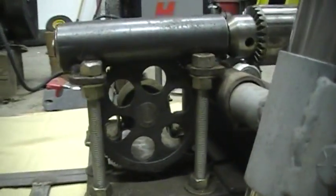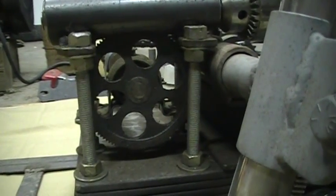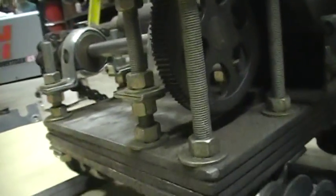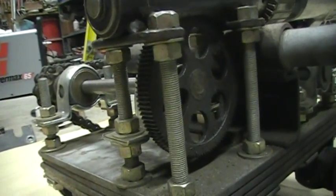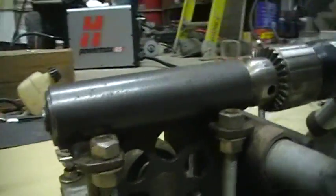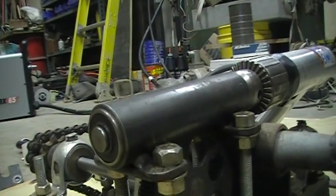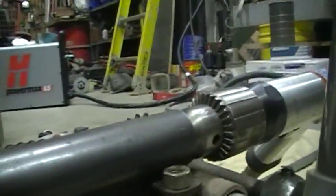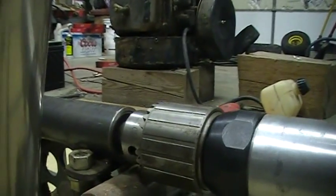On this end I found one of these little antique hand crank grinders. The gear is a really fine tooth gear, and it just so happened that a half-inch coarse threaded bolt laid perfectly right in the threads. I took it up to the top — you can see the bearing I put in there. I machined that out and machined the end of the shaft so it would fit that bearing — there's a snap ring on there. The other end has another bearing, and I machined it down so my air drill can screw on there.